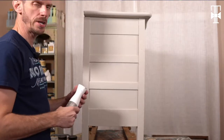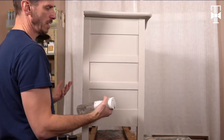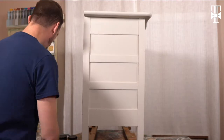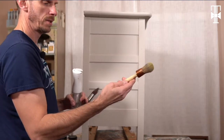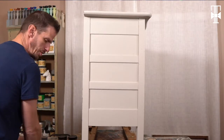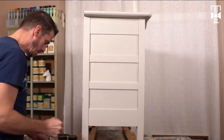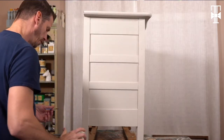I like to always have a mister bottle handy. I'll mist the surface because all these techniques are based on it being wet — and this is another reason you can get away without top-coating, because it's going to be wet. Get some kind of brush — maybe a one-inch or a French tip — something small that will get into the cracks and do your shading. You could even use a craft brush; that's perfectly fine. Let me get a little bit more Voodoo gel stain because I feel like I didn't get enough pigment.